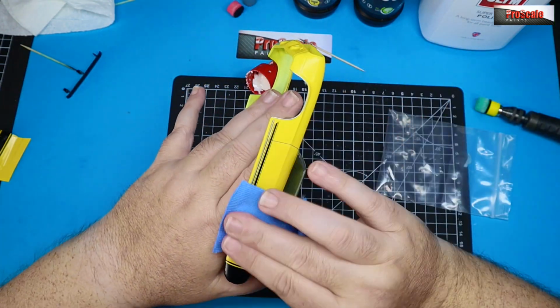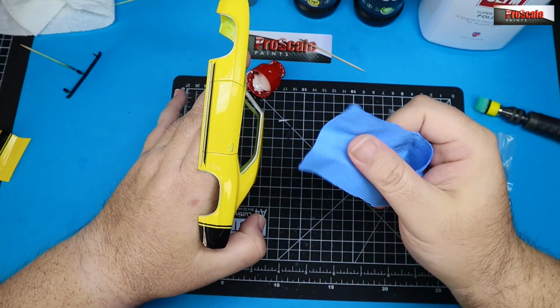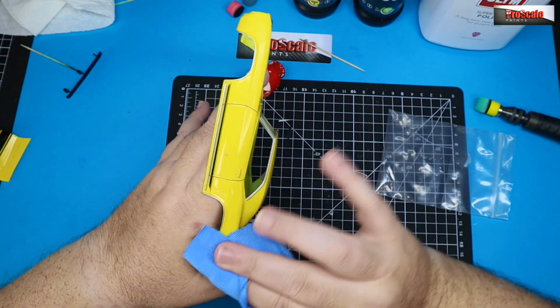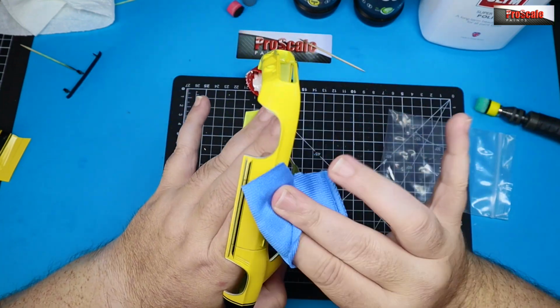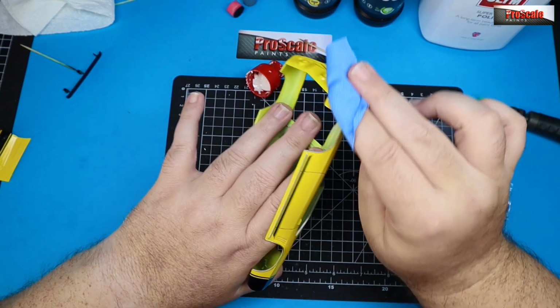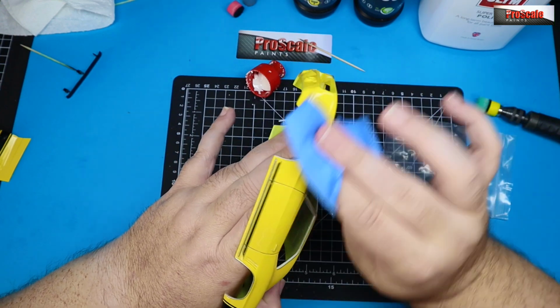And again, once we polish this off, absolutely beautiful shine, even just off this coarse compound. The shine's coming back absolutely beautiful. The Menzerna compound's really nice with a polishing tool. If you're not going to use the sponges or a rotary tool, I'd recommend the UMP ones. They work very well for hand polishing.